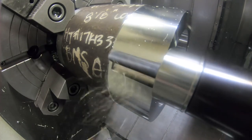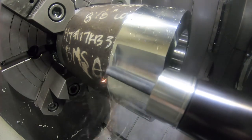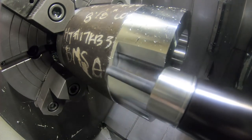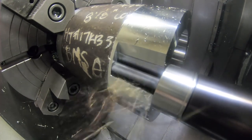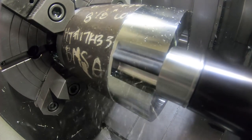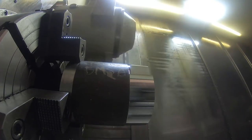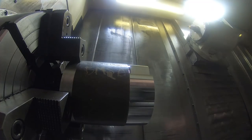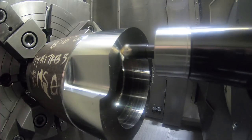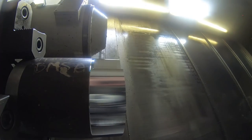I'm going to put spot faces on the face there for the heads of the screw, because I'm leaving about a 3/8 radius in the corner there, and the screw head would hit it. Half inch, 5-flute end mill, 2-inch cut length. The spot drill for the two holes, the tap holes that are going to hold the fixture in. 1/4-20s is what they're going to be.